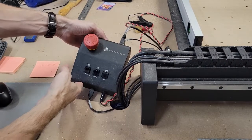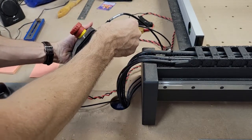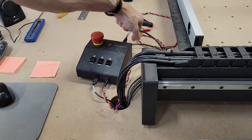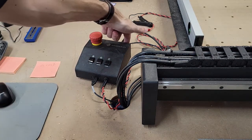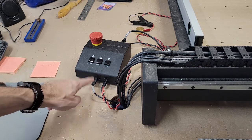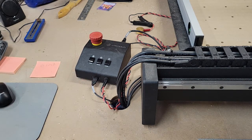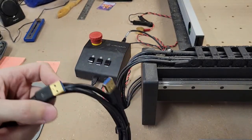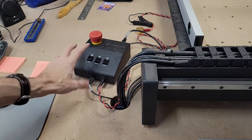The second upgrade has to do with the USB connectors on this control box. You have a USB-C on the back and a USB-C on the front. The way Inventables has you do this is the USB-C on the back goes down into the controller to a USB-A flat connector, and from the USB connector on the back to the front, all it is is a pigtail right through it — no electronics or anything. It's just supposed to be an easier way to connect this device to your computer. So I'm actually going to disconnect both of these and use an A-to-A connector with the two flat ends to connect right from the controller into my computer directly.